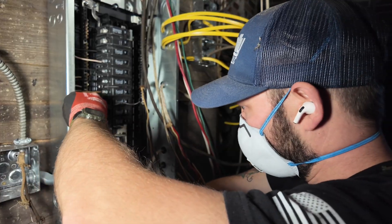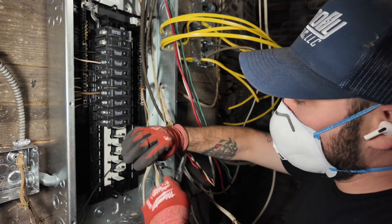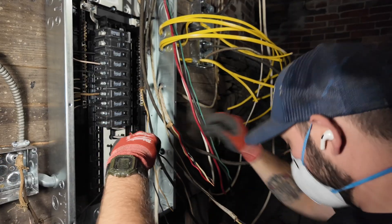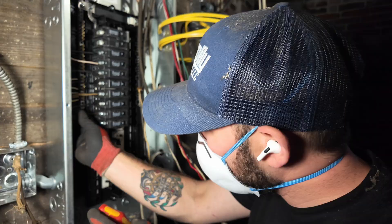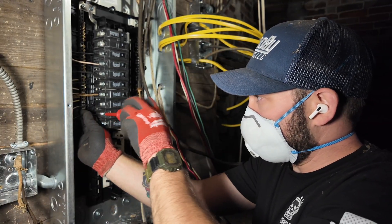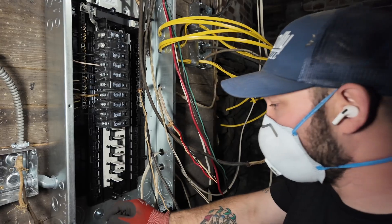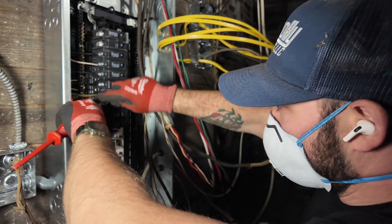This isn't going to show you the ending - this is sort of just the beginning phase of the overall project. There's still the outdoor stuff to figure out. A lot of this older BX and Romex - the insulation was so degraded that I had to use my razor knife on some of them to cut the insulation because the strippers just wouldn't do it. It's that old rubber and old cloth-type insulation. Some of it was cracking and falling off pretty heavily.